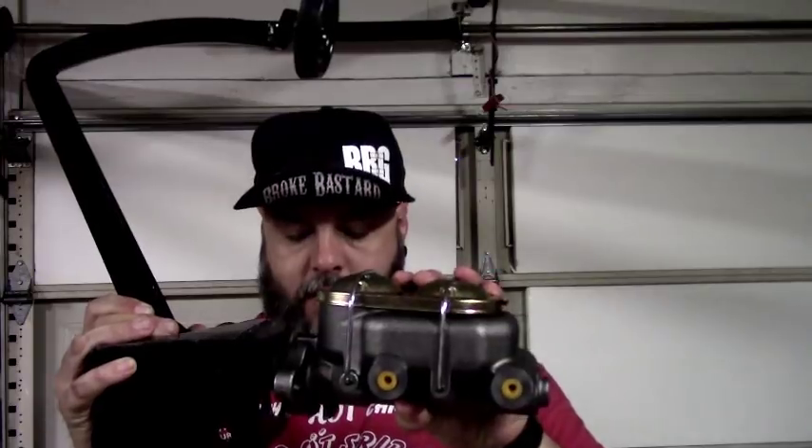The way it works — there's an entire piece here and then the master cylinder comes in under it. The way it's designed, it can either just sit under the floor so the master's under the floor and your brake pedal works that way, or you can mount it upside down and it hangs under the dash. The issue is if I do that, my master cylinder's under my dash — I don't want that — so we're gonna go for under the floor.